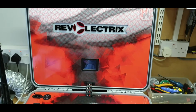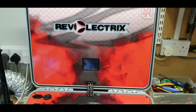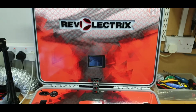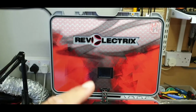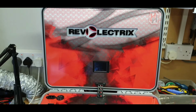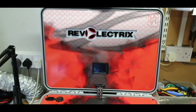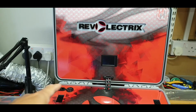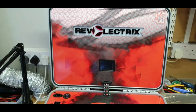Then I peeled the backing paper off the vinyl printed graphic, liberally sprayed the back of it with the soapy water, and laid that on top of the deck, which was actually handy for alignment purposes, because the printer was just big enough to cover this case size. There was no more than about 5mm overlap all round, so I had to be very accurate with my positioning to start with, or else it would potentially be skewed. And then if I weren't careful, we'd get white flashings around the outside. So I had to make sure it was aligned properly.